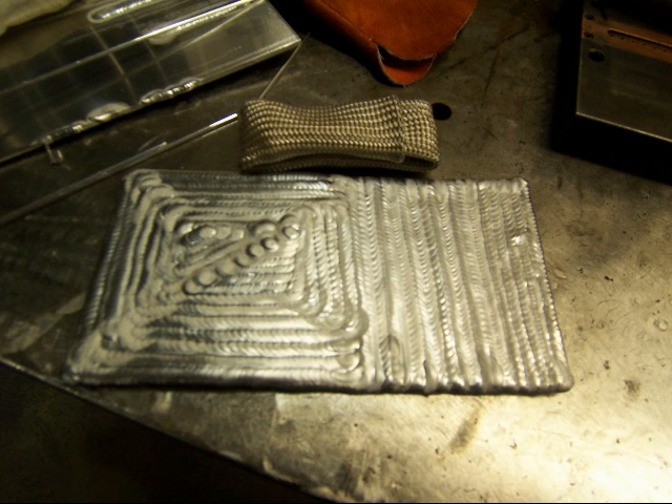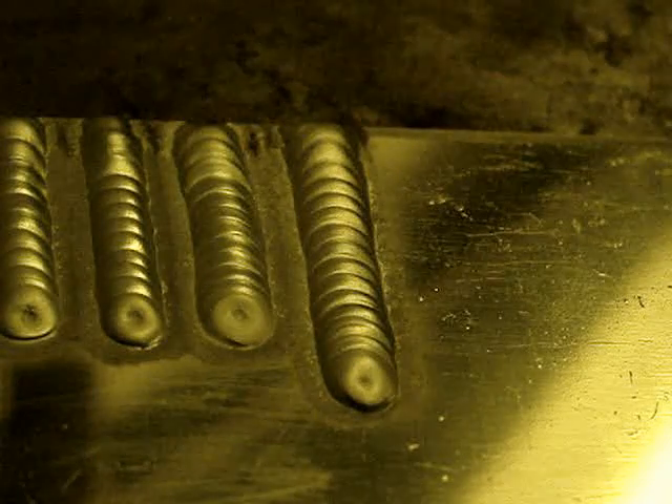You can practice again building up little lug patterns. Practice building a lug pattern two inches square by an inch high. Be creative — this is a good time to learn. This is good practice for welding on aluminum castings even though it's sheet metal, because you're actually making a casting out of it by adding all that weld metal on it.